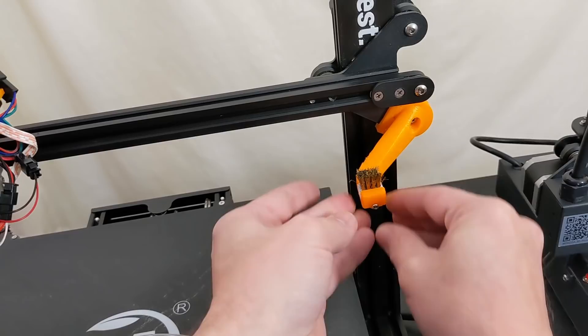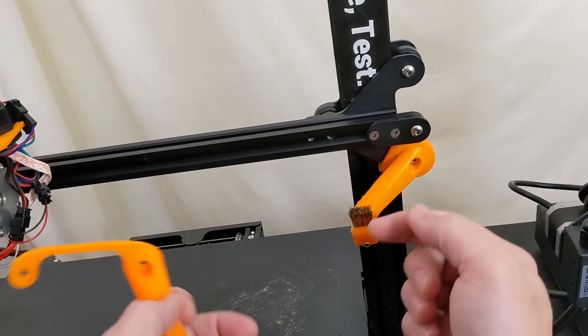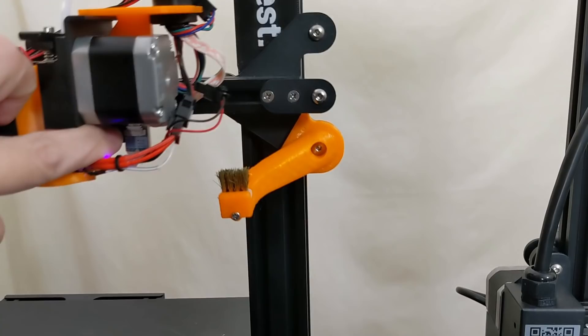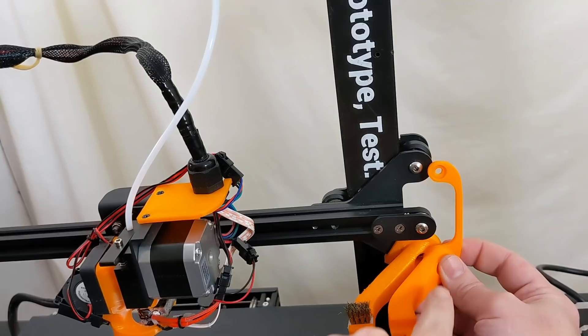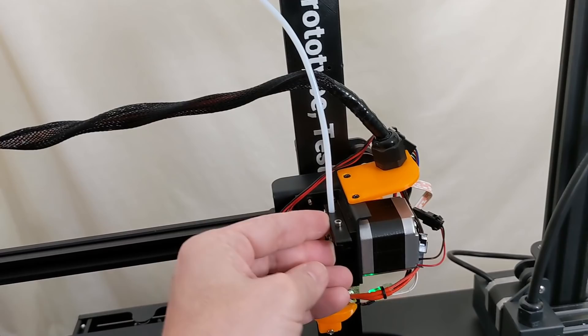Before, when I was making that project, the arm was mounted in a direction where I wasn't able to fully get the hot end to sweep over it. Now the nozzle goes all the way over to the far side and back. I've printed up this new arm — it no longer mounts on two screw holes, it just wraps around and it all works. Really great geometry. This is going to go on the Mingda D2 as well. The Mingda D4 and D2 need no modifications — they just have enough travel to accommodate a brush.